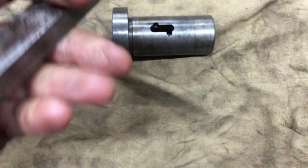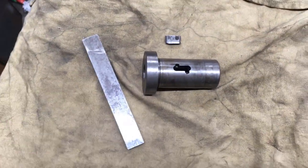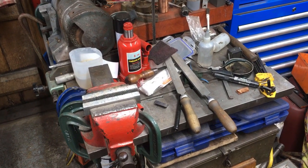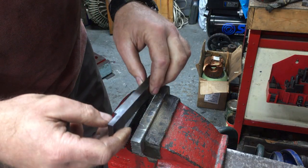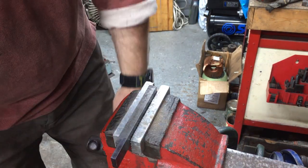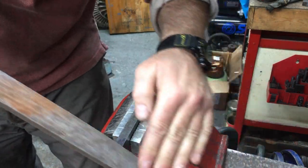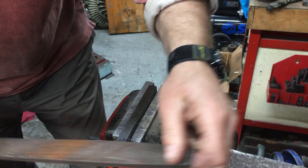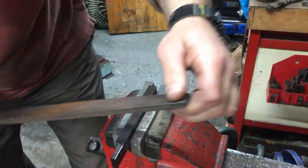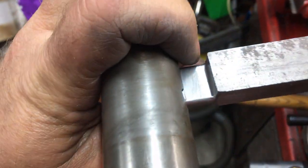The reason I've left it on the block is just for handling and gripping purposes. Once I've got it to slot in and out, I can look at truncating it. So it's a nice little hand-fitting job — there's my vise and my files. And that's it fitted. So I'm just going to truncate it and round it off, then work out how I'm going to key it in.